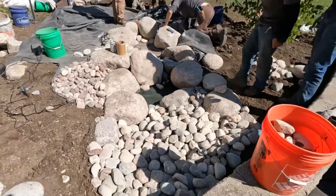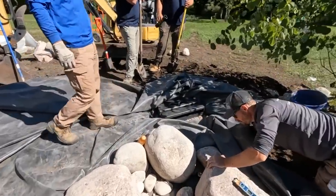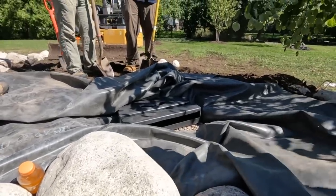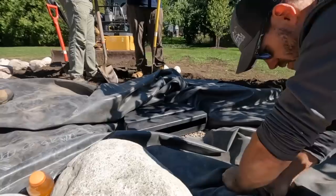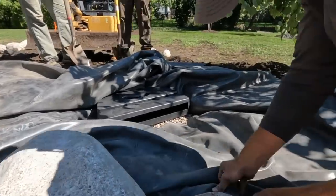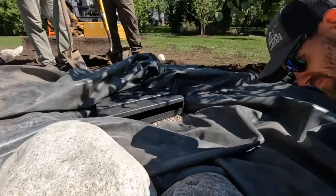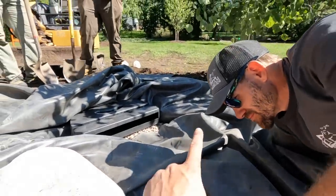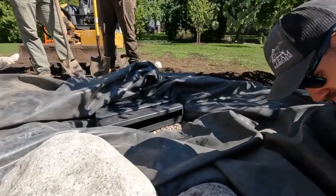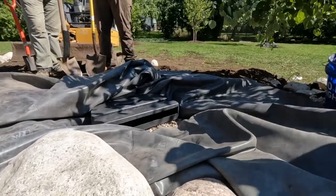Starting finishing touches with one crew working from the basin up. We're only doing two waterfalls in this pondless waterfall — our berm height doesn't allow for three without looking too volcanic. The spillway is sunk below water line so water shoots out, wells up, and looks spring-fed rather than just a brush of water over the top. We'll set a rock on top of the spillway, another where Dan's working, and possibly a third. It's just after one o'clock and we're making really good progress.